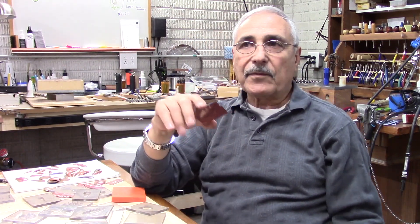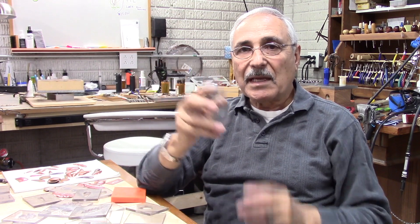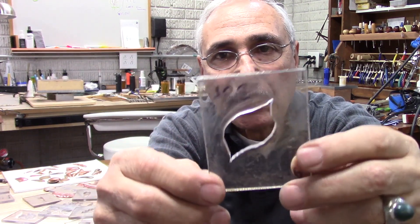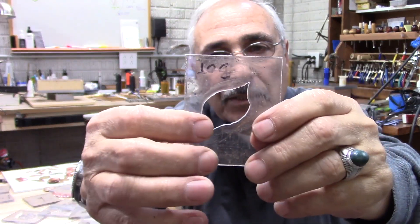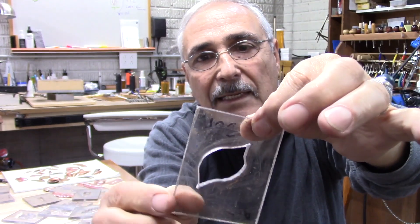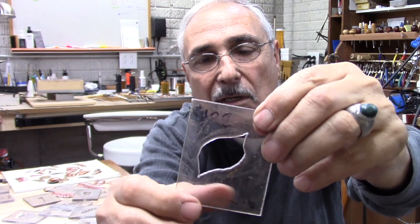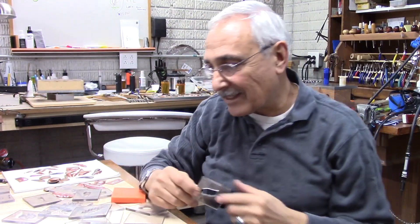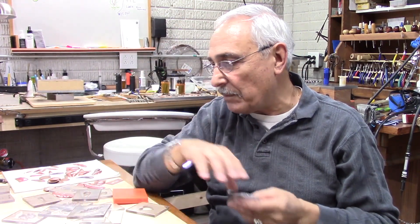You're paying like $75 per plate for steel dies, but with plexiglass it costs you absolutely nothing and it's easy to work. Some people ask me: will it break? No, it will not break, it will not crack — as long as you make sure the distance from the shape to the edge is quite a bit, so you have a strong perimeter around the shape. If it did crack, you can always get a new piece and redo it again for cheap.